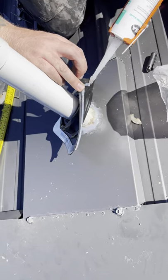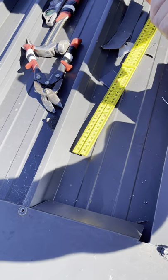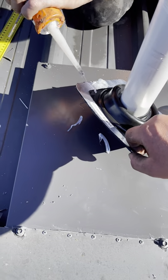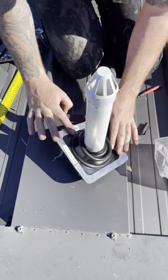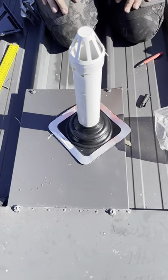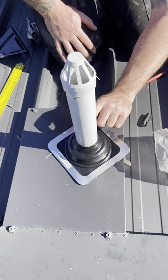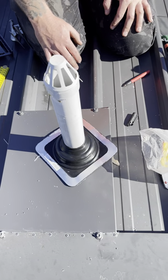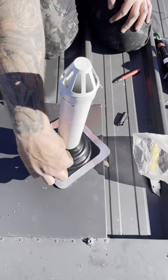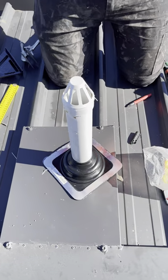We then silicon around this the whole way. So we've got that silicon down — bit messy there, doesn't matter — push it down. Some blokes like to silicon these up, but personally that fit is so tight I don't see how water's going to get past. We've siliconed it twice to the roof and the flashing, and now we're siliconing this. This must be tight — if it's not tight you need to silicon it. That's so tight you don't need to silicon it further; there's no water going to get past it.